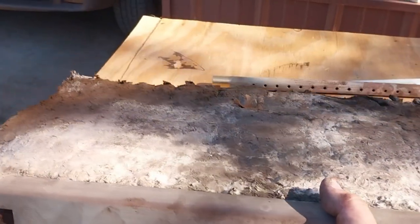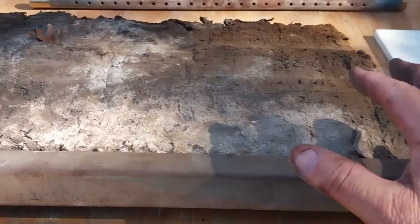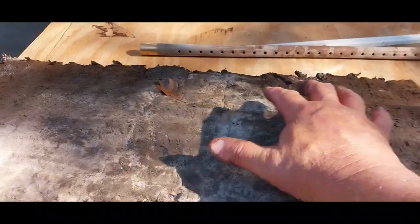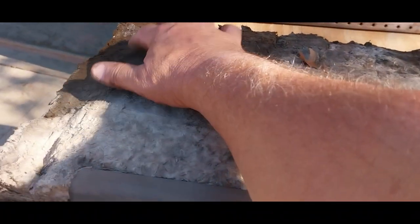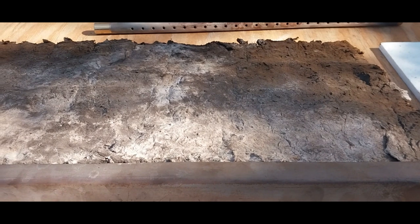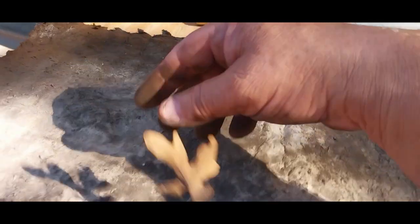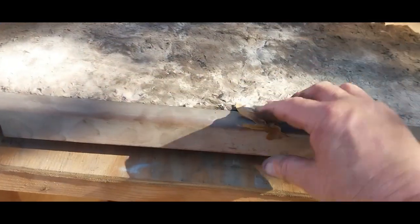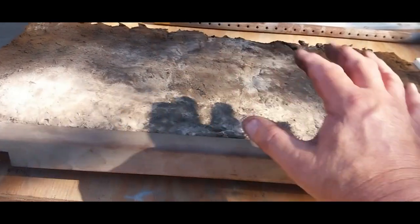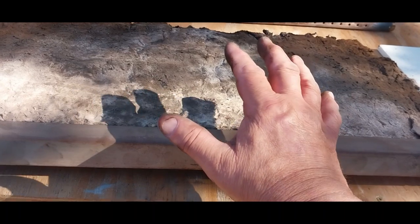You take it outside and start to disassemble it. Usually this is all full of soot on top — you can see how dirty it gets, that's normal. I have replaced this pad once, about two years ago. They just start crumbling and become no good. When you clean these off, don't try to brush them because they fall apart. All I do is turn them upside down, tap them lightly, and everything comes off.